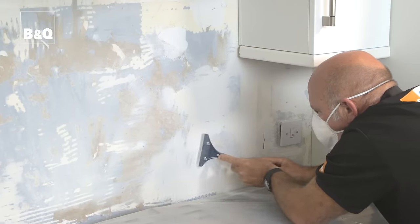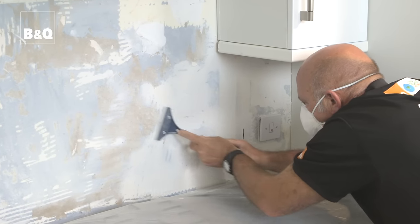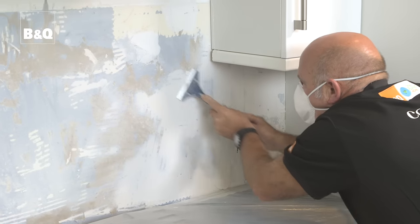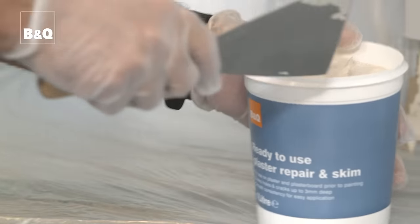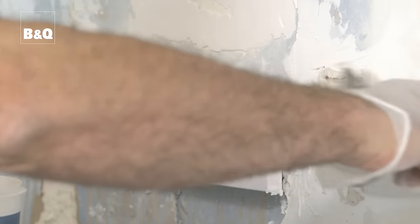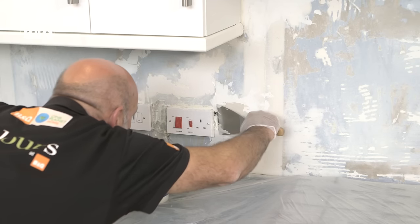Before we set out the position of the tiles, we have to prepare the wall surface. The surface should be flat, firm, dry and free from any grease. Using a face mask in a well-ventilated area, scrape off any wallpaper, flaking paint or crumbly plaster. If the wall has any defects such as damp or decay, these must be repaired first. If you're in any doubt, seek specialist advice. Now fill any holes or uneven surfaces, but don't overfill and make any bumps. You can use a straight edge such as a spirit level to check for bumps.